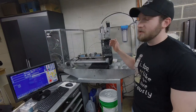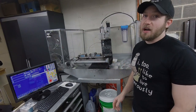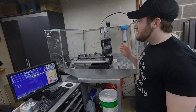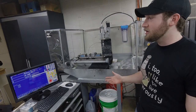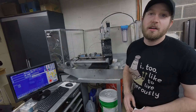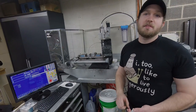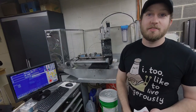The big thing with the machine was control. I had huge problems getting the controls to work with the ClearPath servos, the probe, the tool setter — all those different things talking to one another. I originally had steppers and a Gecko G540 board running Mach 3, but was losing steps and having issues cutting knives correctly. I moved up and switched to a CNC4PC C62 board, but spent weeks having wiring issues — couldn't get the servos to start, Mach 3 wasn't communicating. The biggest problem was the board had bad solder joints on the surface-mount caps and diodes, so there was no conductivity. It just didn't work.